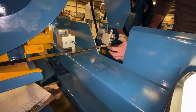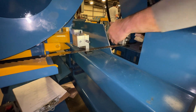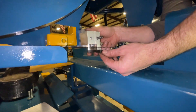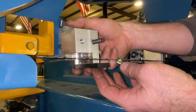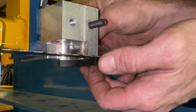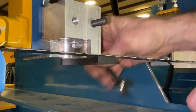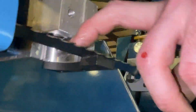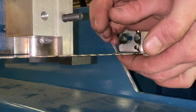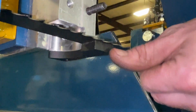Once you have both sides set, go back through and make sure the bolts on your L-bracket are tight on each side. Then lift up your block until the bottom pad is completely flush — not too much, not too little, just perfectly flush. If you tighten down a little bit at a time on these nuts it'll keep the block from twisting. You can tap on either side and hear that there's no daylight underneath. If it were twisted you'd hear a sound. You can also get below the blade and visually check for any daylight.